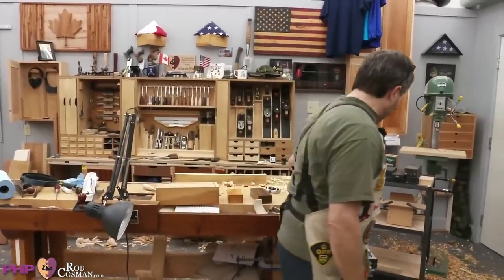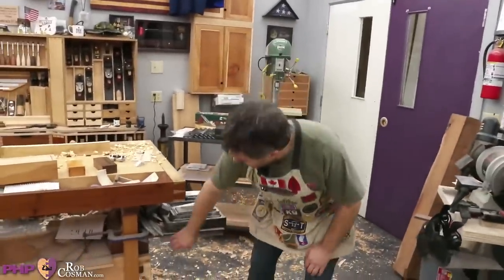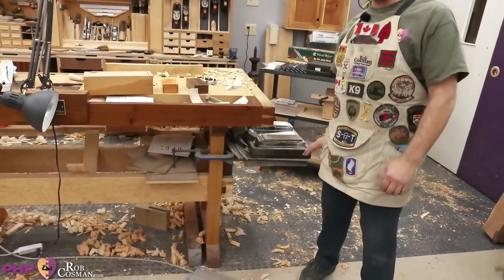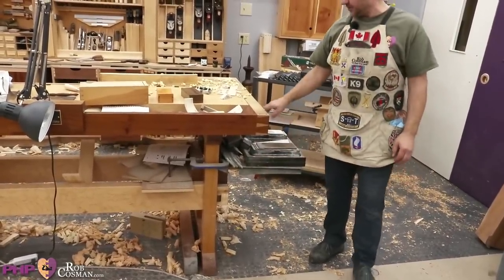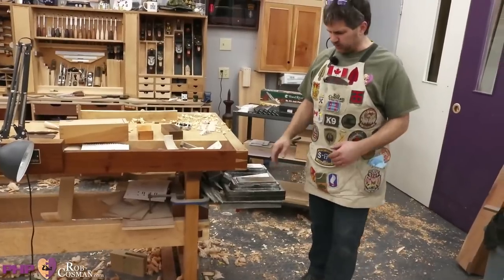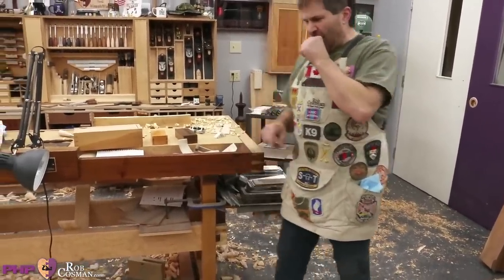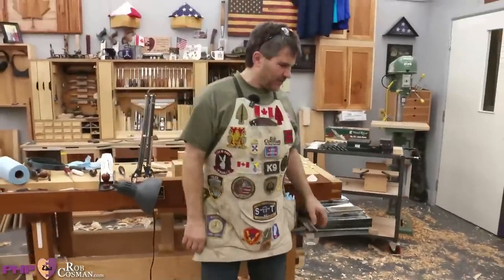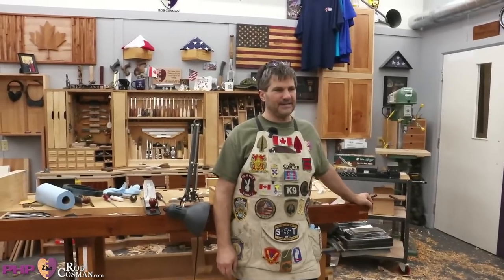Yeah, a piece of three-quarter ply, usually exterior, so that the water doesn't bother it. I mount it, the block here, I cut about a 1 or 2 degree angle on there just so that it slopes ever so slightly away from, now, I think Jake did this, but I got a piece of rubber on there just to keep the water and mess off of the end of my bench. But 3/4 inch piece of plywood, 12 by whatever width you need in order to hold everything. And I always screw and glue it. If you just screw it, there'd be a little bit of flex in there. But if you screw and glue it, that's just like welding it, and that'll hold, and I've never had to change it.